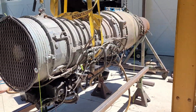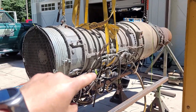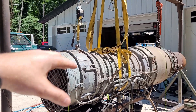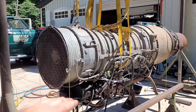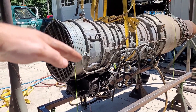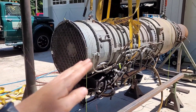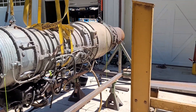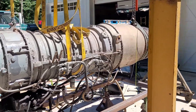We'll start measuring and cutting cross members. We're going to have a hoop come up top with an adjustable link so we can adjust the angle of this thing. I did a little math to make sure there's enough room underneath — so if we're five degrees tilted up or five degrees tilted down, we won't bottom out the gearbox on the floor. I'll give another update once I get everything welded in and it should be ready to sit on the pontoon.